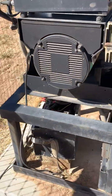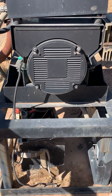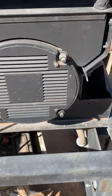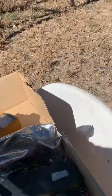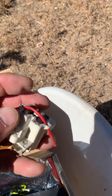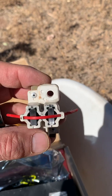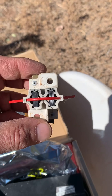When it did stop making electricity, we found the problem was actually the generator brushes. The generator brushes are a single unit block. We pulled four screws, opened it up, and you can see the access to them — they're pretty inexpensive. It's just a simple block with a piece of straw through it to keep the brushes from popping out. There are two spring-loaded contactors that go onto the armature — two bolts and two wires to hook up — and that was the fix. Pretty simple. We keep one as a backup; it's not crazily expensive.